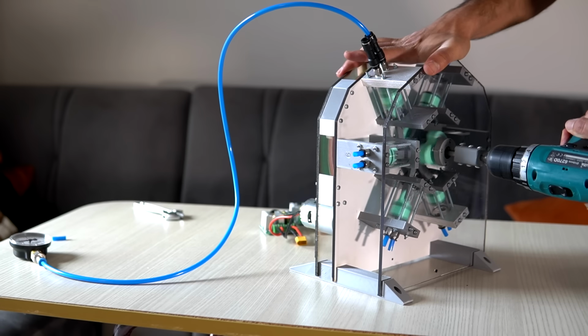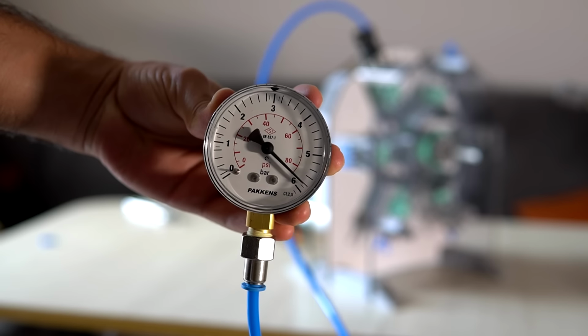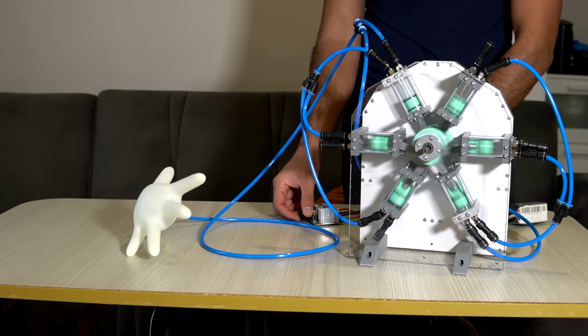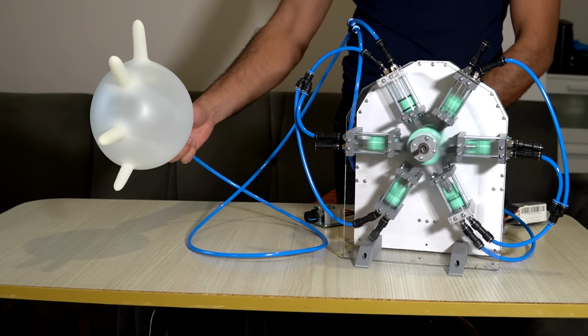While I'm fitting the pneumatics, I will do a compression and a vacuum test for each cylinder. And starting with the cylinder number 1 with the aluminum cap, the metal shows the difference. It's already maxing out the gauge even when it's turning slowly. But of course, it might just be because I'm attaching the gauge directly without a tank. We'll test it for real soon.